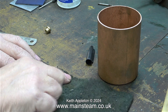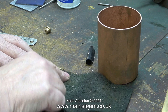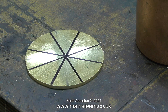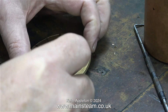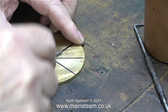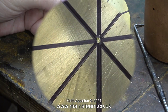Using a piece of scotch brite I'm erasing the felt tip pen marks so I can make some more in the correct place. I measure the diameter of this part and get it to be three and one-eighths of an inch. Using my felt tip pen I put a mark in the centre, then draw a few more lines on the piece of metal, all of which pass through the centre. I'm using a spring-loaded centre punch to make a mark in the very centre of the work, and I got it wrong — but by repunching at an angle I corrected the error, so this mark is now in the centre, or at least as near as it needs to be.